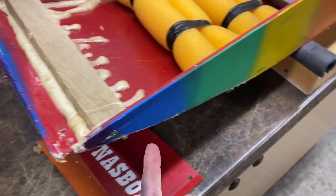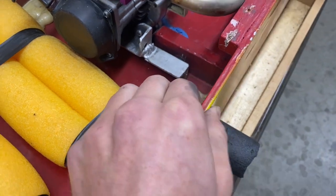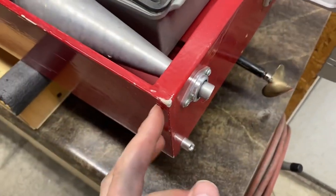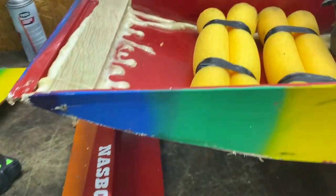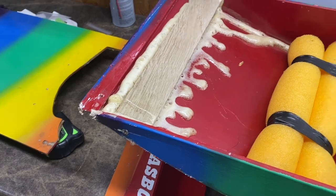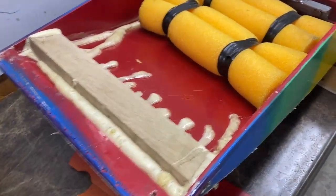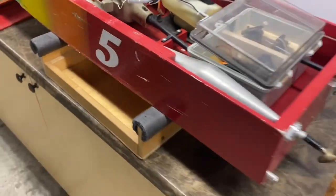Inside the boat you can see it's basically made of four pieces of wood: two sides, your transom in the back, and then your bottom just runs down like this. This one's made out of poplar that I had planed down to be about five-sixteenths thick. The back is a little thicker — you want your transom nice and sturdy so you can screw things to it. The bottom is made out of quarter-inch plywood and it just bends right up. When you're constructing the hull, you want to use gorilla glue. This boat had a little incident where Banks was learning to drive last summer and hit the dock, and we patched it with a piece of wood and a bunch of gorilla glue — you can see what the gorilla glue looks like in the corner; it makes a nice weld-kind-of bead.